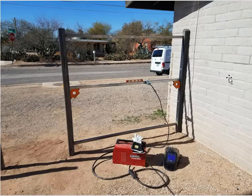So having 1.5 inch stock across the top gives us options to do that, which is one of the reasons why we went a little heavier than we probably needed to do. We did 3. We were concerned about the wind loads. Fences do get knocked down around here, and I have seen some weaker metal fences with thinner gauge corrugated metal buckle, get creased in the middle. So we wanted to make sure that wasn't going to happen to us. In the fullness of time, now that we've done this, we probably could have gotten away with just the 2, but we wanted to go 3. We wanted to be real close to the ground in case tenants have dogs. I don't want dogs pushing on the bottom and flaring it out and whatnot.